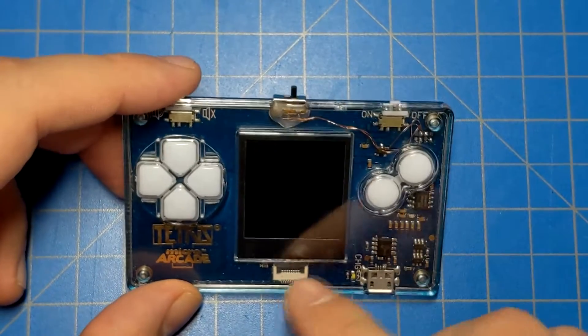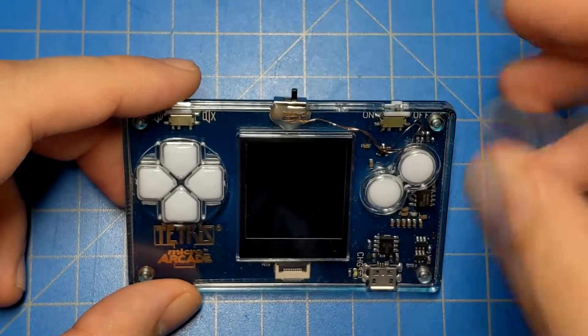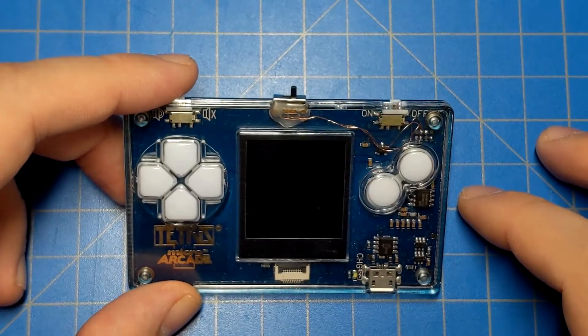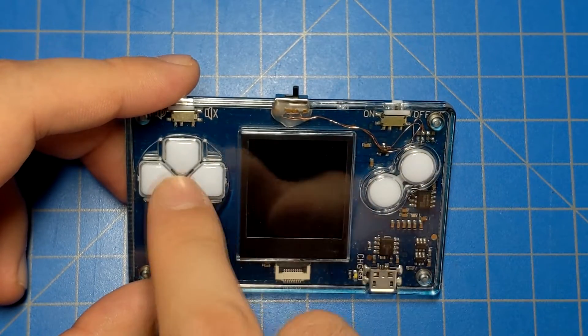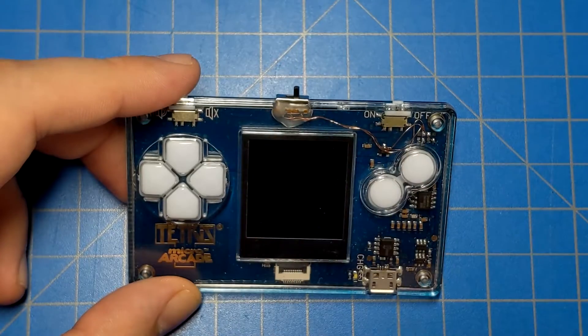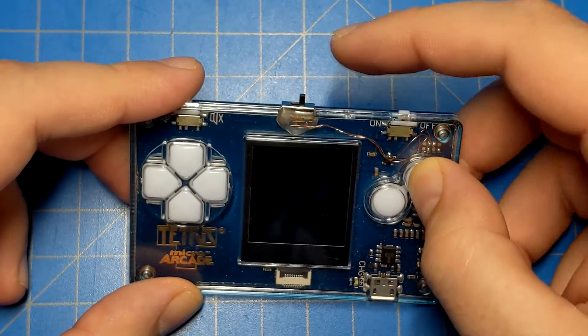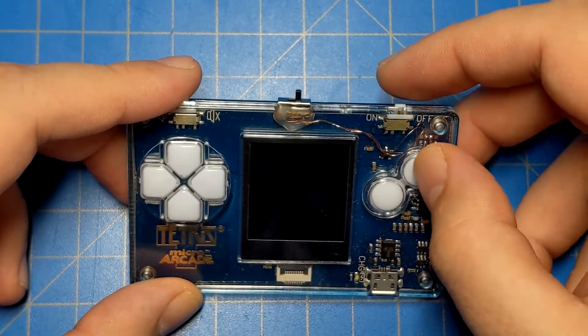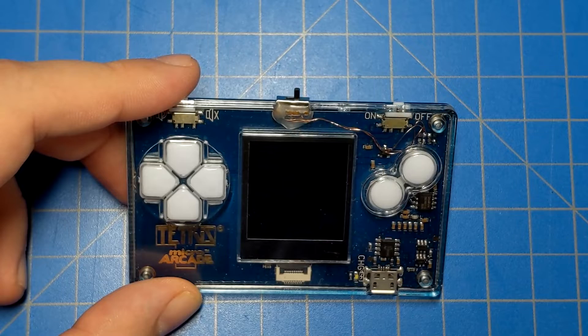In the comments to that video, somebody suggested that instead of adding a bulky switch up top, I could have just run wires from those pads over to the different buttons in the game and hold down one of those buttons while powering the whole thing on — that's how I could select the game without needing an external switch.